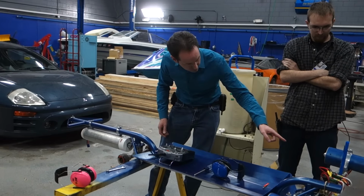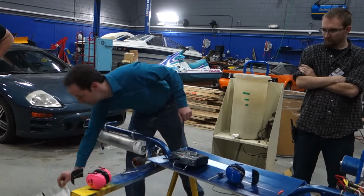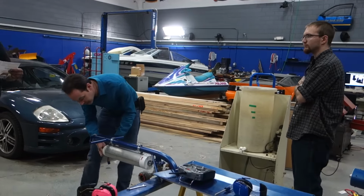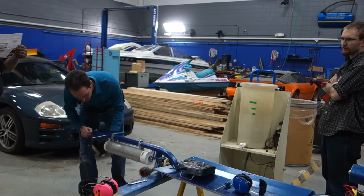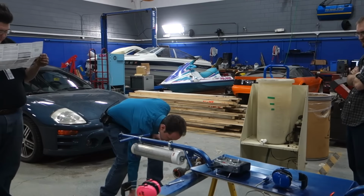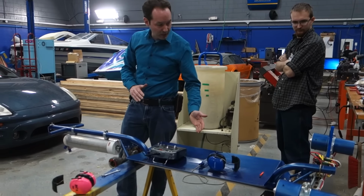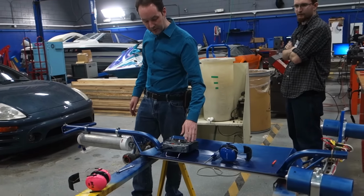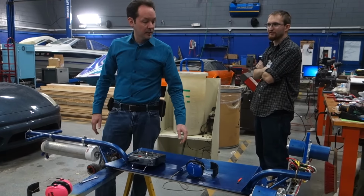I know we're bound, because it's seeing me, so it's an ESC setting, but you read this and see if you can figure out something for binding the ESCs that I'm not doing. Well, sometimes there's safety stuff, and with the ESC, with some of them, you gotta hold the throttle at a certain spot and power it, and it's weird. It's like after it gets over a certain amperage, it makes sure you know what you're doing.